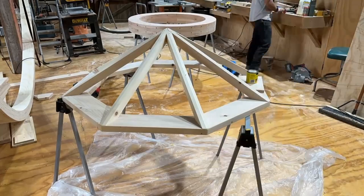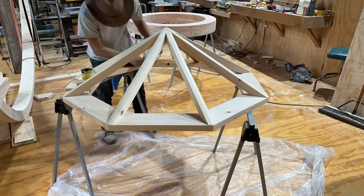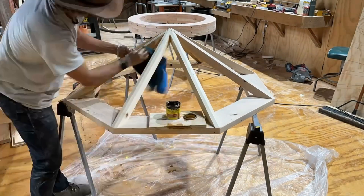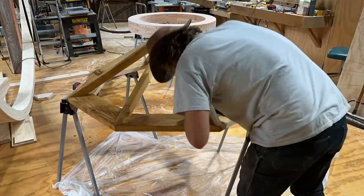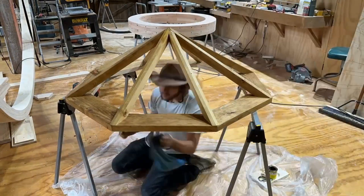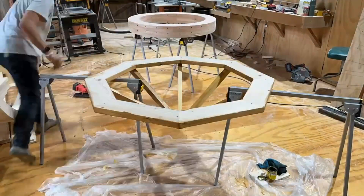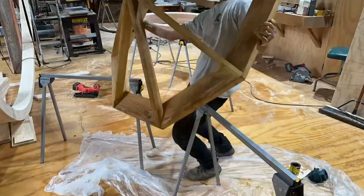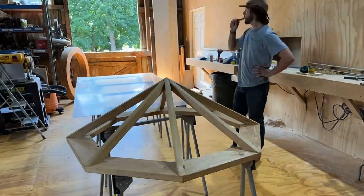With the wooden frame complete, it's time to do the easy part — a little bit of staining. I don't typically use or buy any fancy tools for this part. I just use a microfiber rag, and I feel like this helps me control the color I get with the stain. If you use a rag, you can wipe the stain in, wipe the excess off right away, and kind of see how dark you're getting. And if you want, you can always go back and do another application. I found this to be a helpful way of getting the color matched to where I want it.